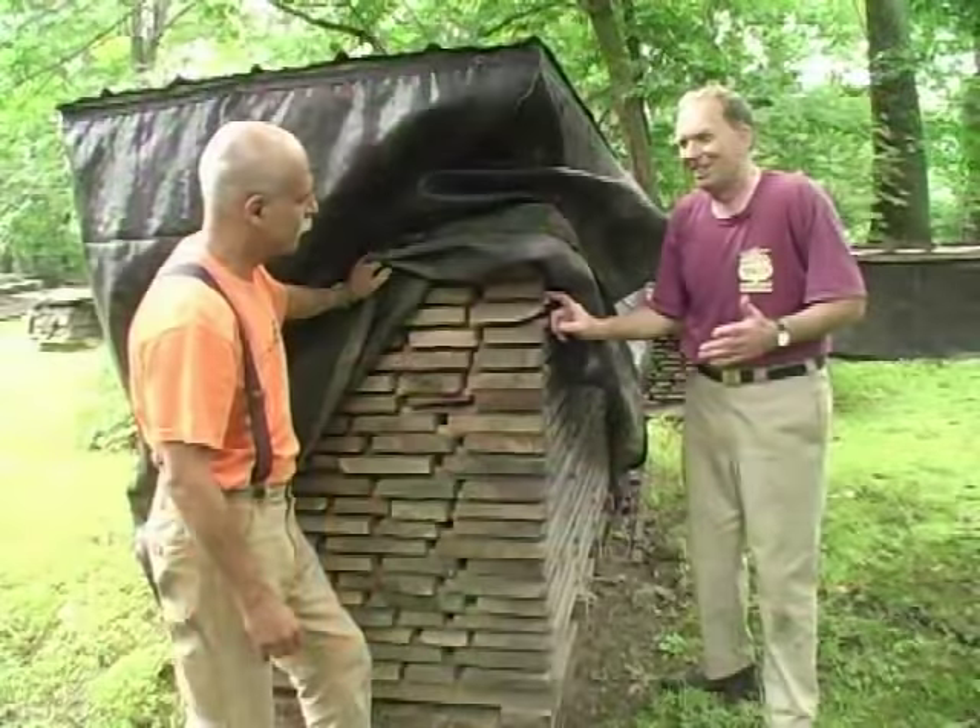I think people get overboard with kiln-dried. I once built something in a laundry room that had a lot of moisture using overly kiln-dried wood, and I would have been smarter to use air-dried lumber — all the doors swelled up and I had to move the hinges to make them fit again because my wood was over-dry. The secret is matching the end use with the dryness.